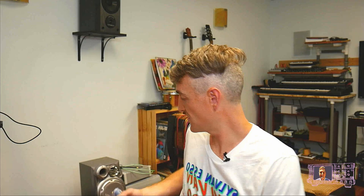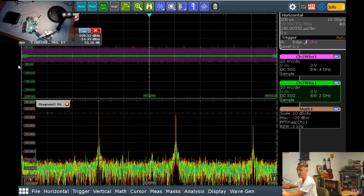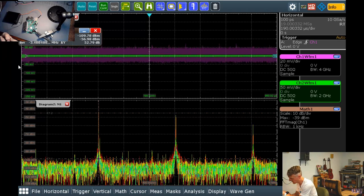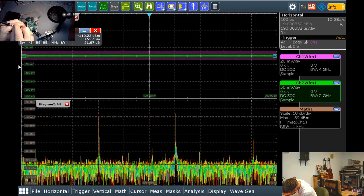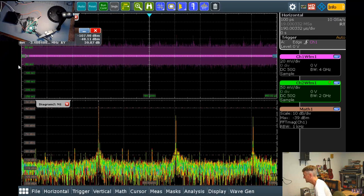We're looking down here at 5 megahertz. Let's turn on a second channel on my oscilloscope. Let's also show the oscilloscope real quick. So here's my oscilloscope. I have channel 2 on now. I have my little header adapter for my power rail probe. Let's look at the 5-volt rail and ground. Right here is ground. Man, I am so glad that I threw on those labels. If I hadn't put that label on my header, I would not be able to do this. I'd be having to stop everything to go back and try to make it work. Okay, so now I'm looking at the 5-volt rail.